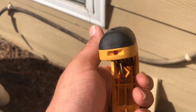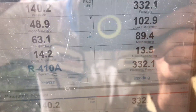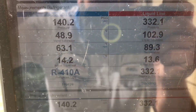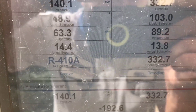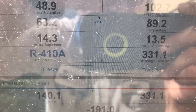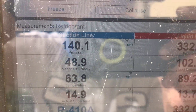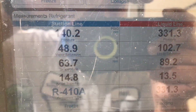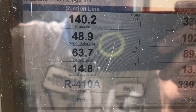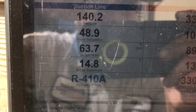Let's get our gauges hooked up. So the Delta T is around 14, like we said, and this is why you want to go off of subcooling when it's a TXV, or superheat when it's not — it's very important. Because if you weren't looking at your subcooling, these systems should be around 12 on the subcooling, so this thing's pretty dead on.